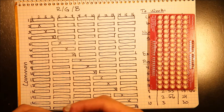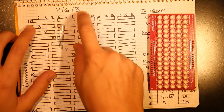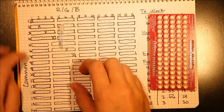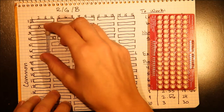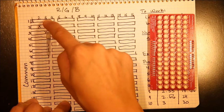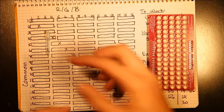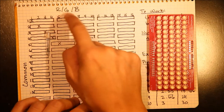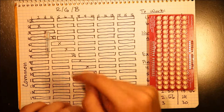So basically, in this graph, the red, green, and blue pins are all the sides that need to get the high voltage, and all the common pins need to get low voltage. I combined them in these rectangles to demonstrate which LED package each group is in, because you can't separate the red light, the green light, and the blue light. They're already packaged in the same LED.